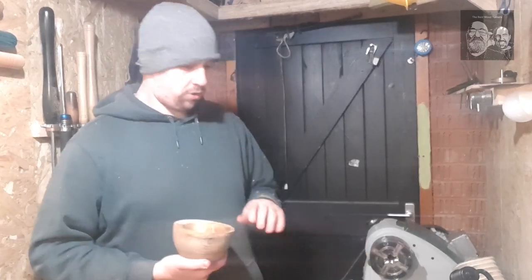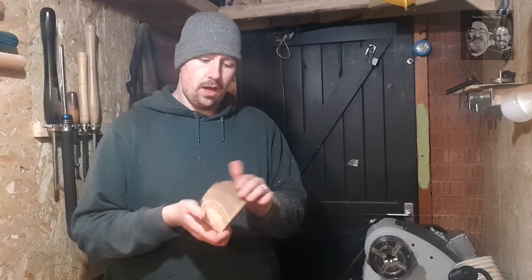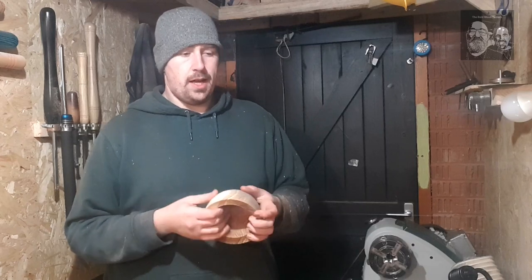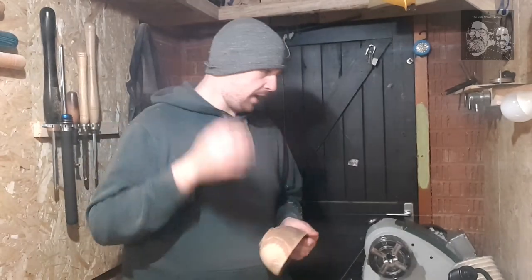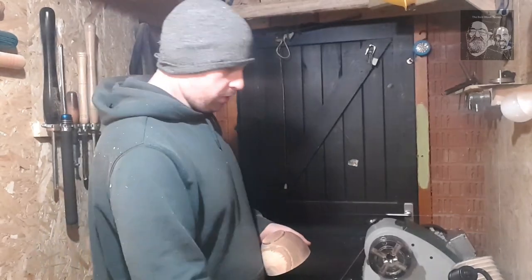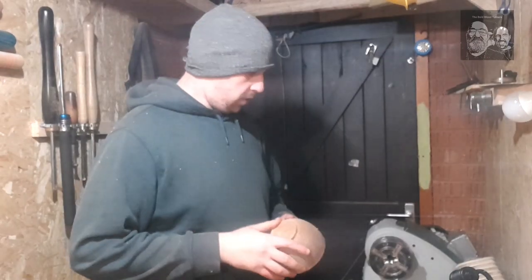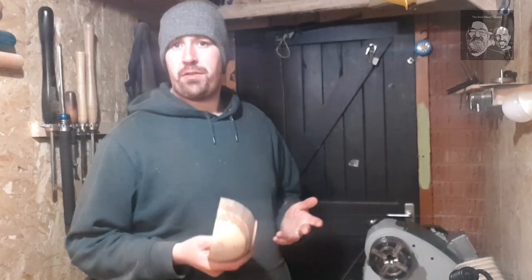You know, it reduced the wobble in a very wet piece of olive ash as well. Obviously, the olive wood being much denser than the sapwood, it creates quite a lot of wobble, which it did on my other lathe on the CL3. So obviously, it really dampened that, which comes with one, the weight, and two, the cast iron build of it. It's fantastic.